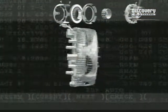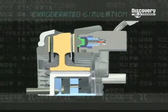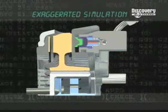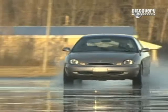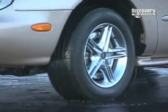The new floating disc brakes have 2 pads of friction material on 360 degrees of the disc's circumference. When the brake is applied, hydraulic pressure activates the diaphragm, which applies pressure on the pad, which is then pressed against the disc. However simple, the design of this brake called for a complex development.